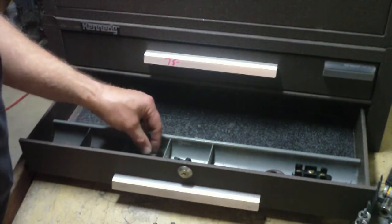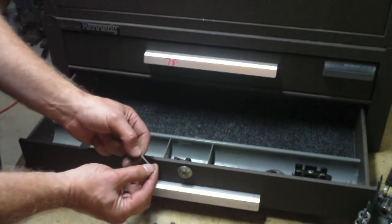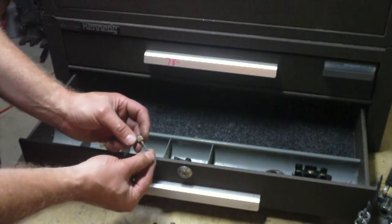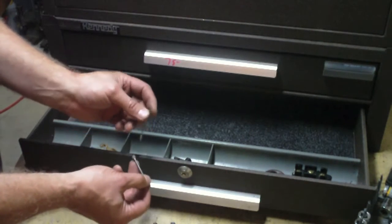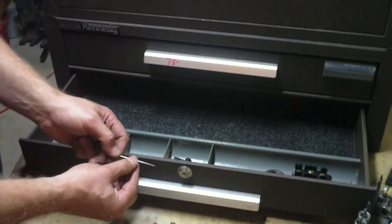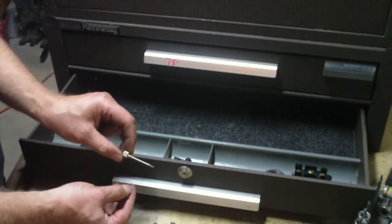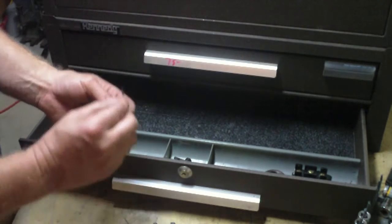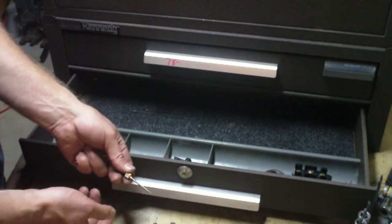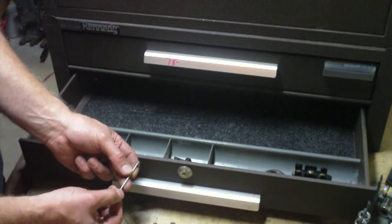Okay. Grub screw, a couple other nonsensical things. Look at these right here. Anybody know what these are? I know what these are. A little sharp scriber point with a little knurled knob on the end. And there's one there. And what these are for is squares. Combination squares in particular, there's usually a place on the square to store a scriber, and these go missing a lot. These are probably off of a machinist square, maybe even a Starrett, although how you would know beats me. That looks like it might be off a cheaper one. This one looks like it's a little more precisely made.